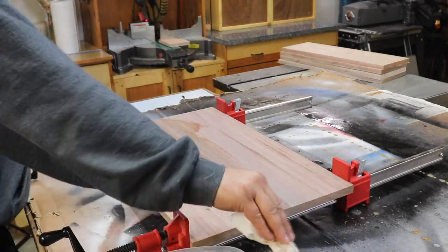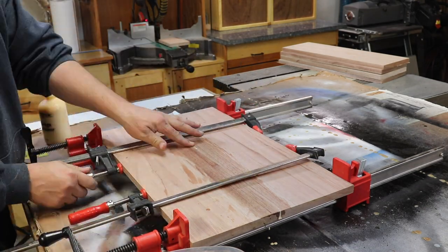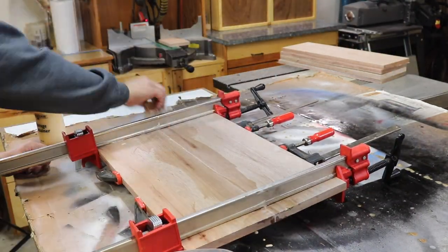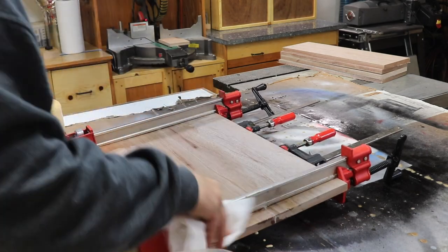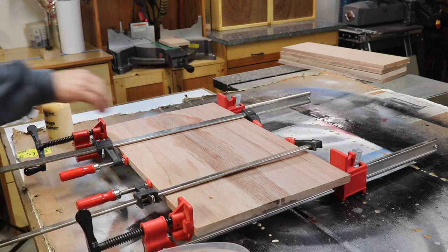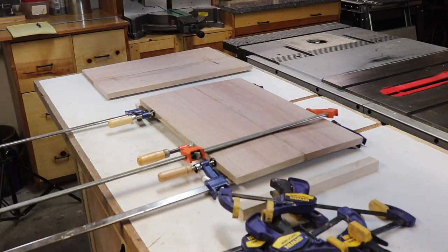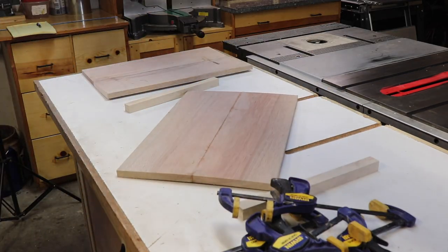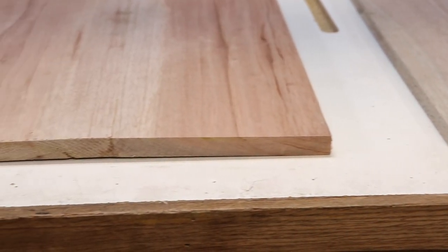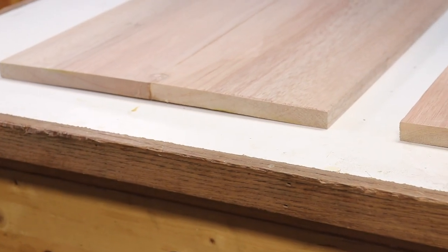At this point, I didn't know it yet, but I just made my life a whole lot harder than it needed to be by using water on very dry wood to clean my glue squeeze out. So here's the result of all my effort, folks. All my panels were cupped and I'm too stubborn to start over, so I'm going to try a different route.